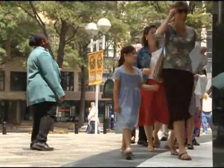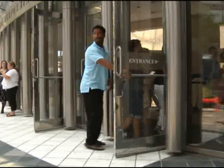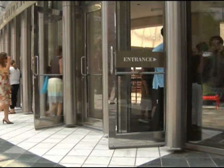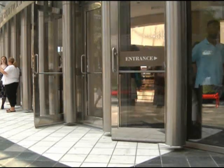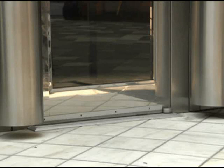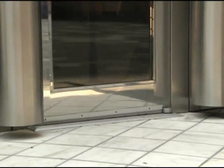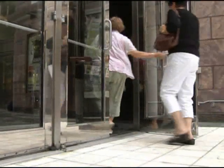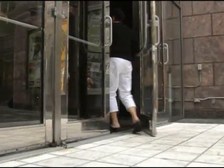Floor closers, aided by door and frame-mounted pivots, are invaluable because they alleviate stress on the door frame by distributing door weight to the floor rather than the jambs. High-use and extra-heavy doors generally outperform doors hung on butts or continuous hinges. With closers concealed in the floor, decorative doors are free from exposed hardware.